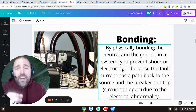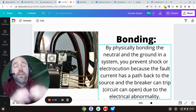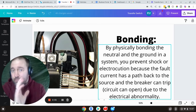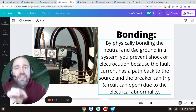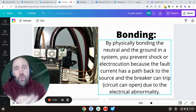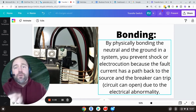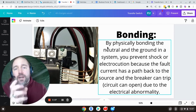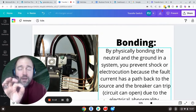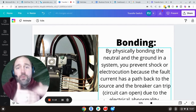That's where bonding comes into play. If you're worried about whether you need to ground your generator to keep from getting shocked, what you're really wondering is: do I need to bond my generator, or have it be a floating neutral generator? Bonding is when you physically link the ground with the neutral inside your generator, so the ground wire provides an alternate path back to the source. That will trip the breaker when it senses abnormal electricity flowing, and that will stop you from getting shocked.